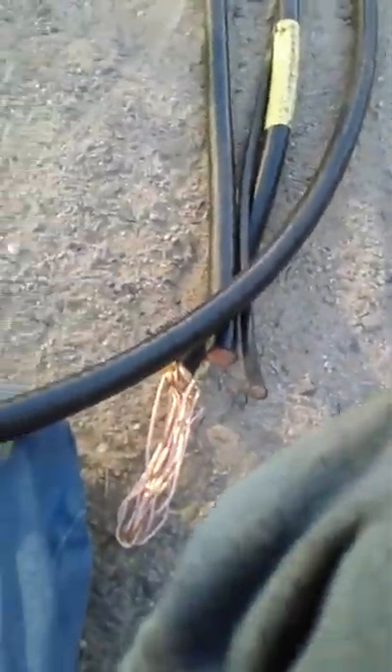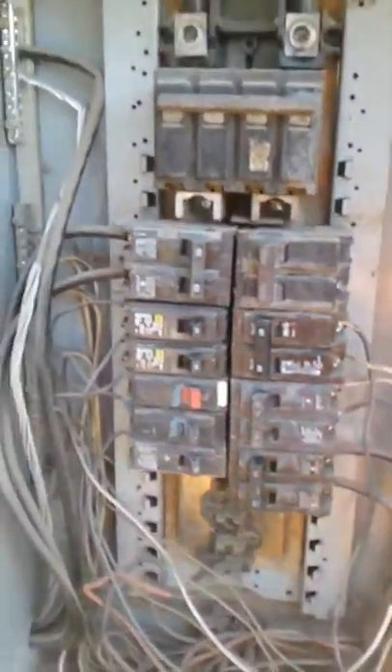As a comparison, I'm going to take this piece of wire right here and bring it over to my breaker panel. You can see the size of the wire that's coming into my breaker panel here. Now look at this size wire — that's just one of those. There's three of them that go into our panel. There's only two here because we only have 240 volts, but I'm dealing with three phase. And this right here is high voltage — this is applying 480 volts instead of 240 volts.